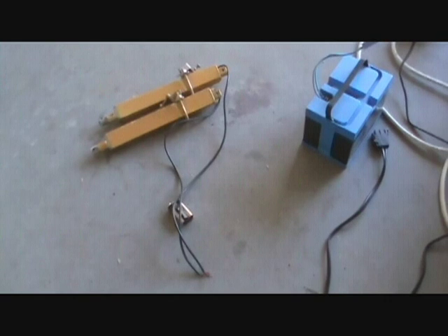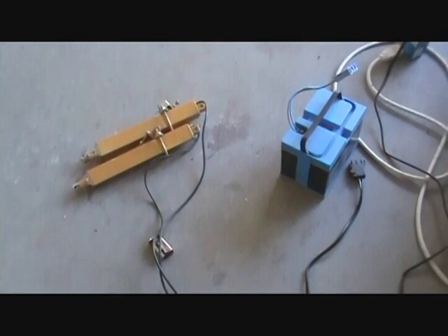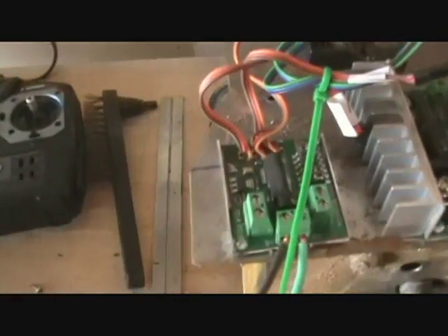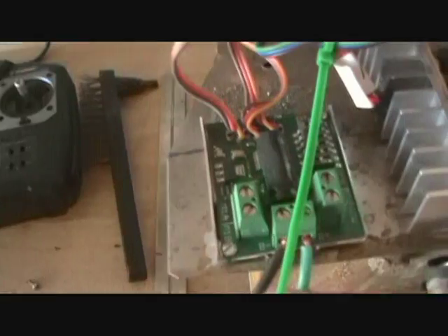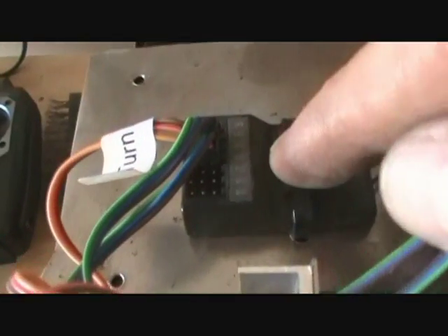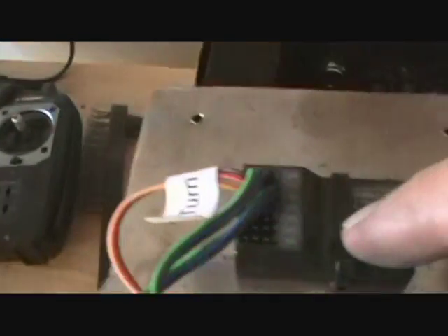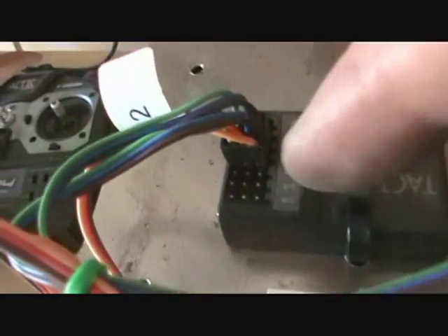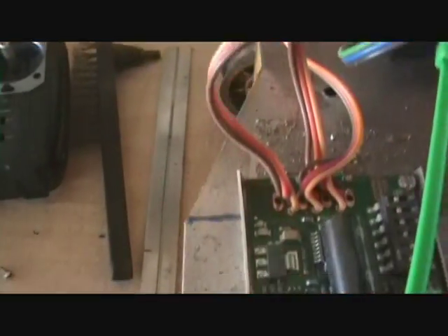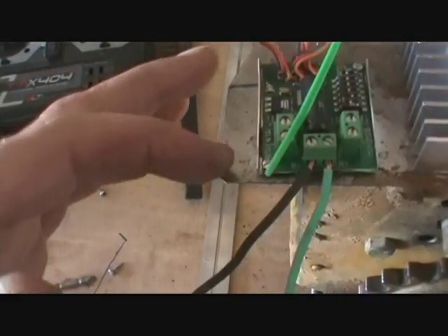So how does it work? I just showed you how it connects to the battery and it'll go up and down. But on the model here, it's always being powered from the battery. In order for it to go up and down, there's a signal it receives from the remote control that goes to the receiver. It just requires this yellow, red, and brown wire here going into the controller. Once I control the stick for up and down, it relays current to the motor to go up and down.